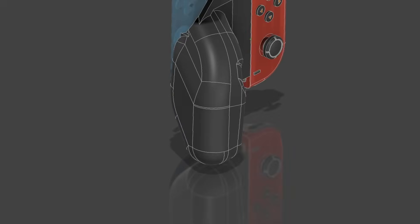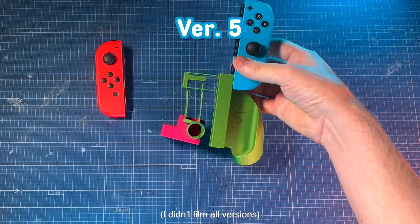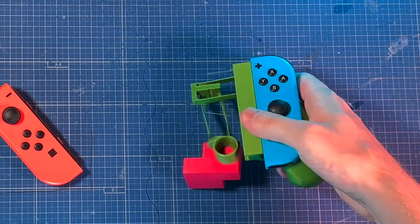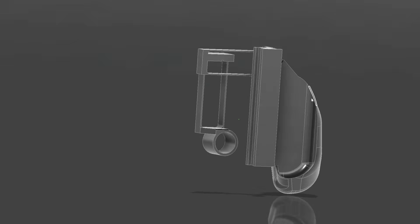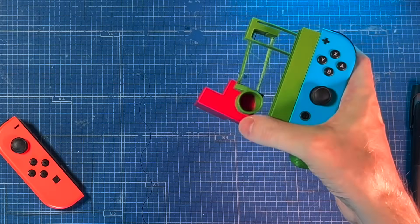I've also added a little notch here — it'll become useful later. And next I've added this compliance mechanism. It's called a flexure. I'm using two pairs of these so-called blade flexures, so that this ring piece can freely move in two dimensions, but it's stiff in others.